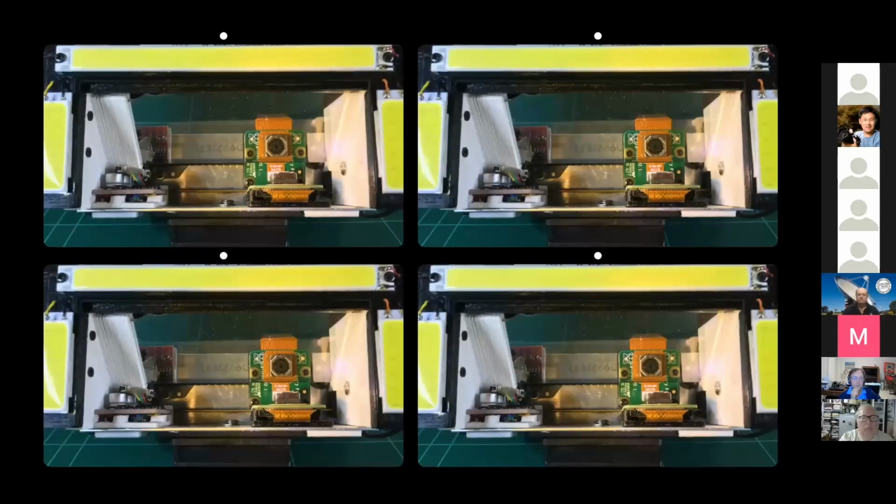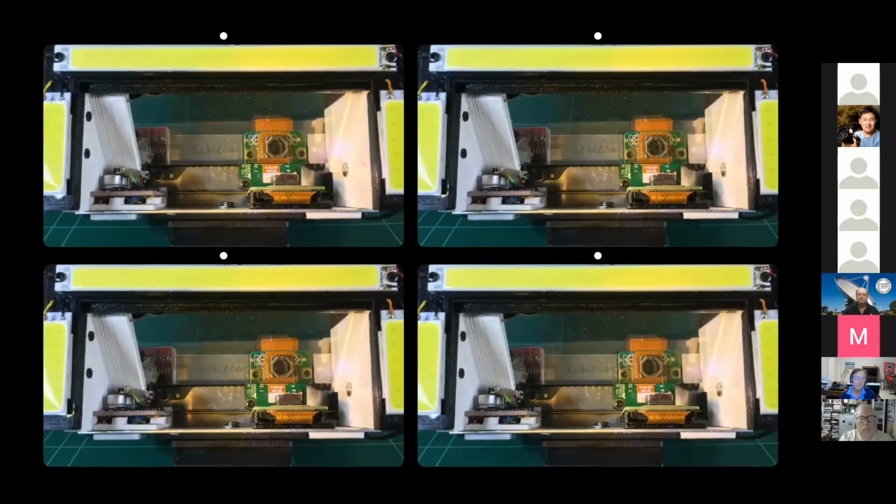And you can see the two camera sensors. There's one horizontal and one vertical, and at this particular time, the two sensors are perfectly overlapped. They're both looking at the same thing. So you can adjust the position of the rear sensor, so you can adjust the stereo base. Here, the two cameras are just about 2 millimeters apart, and it looks like there's kind of a double vision, but that's because there's a half silvered mirror at 45 degrees, which you can just make out on the sides. You can see there's a 45-degree line, and that's the mount for the mirror.